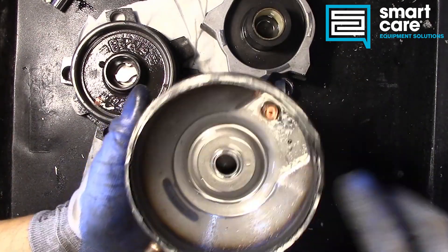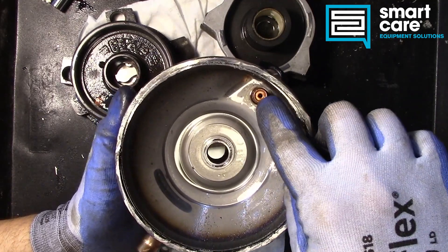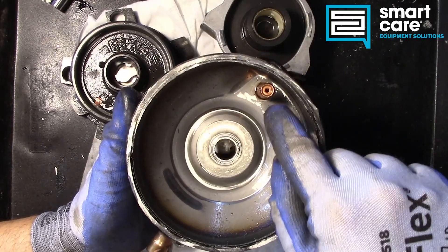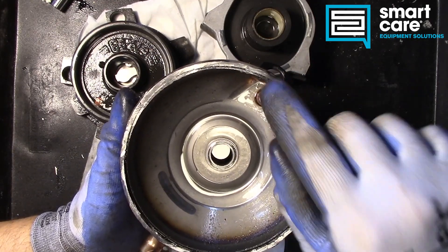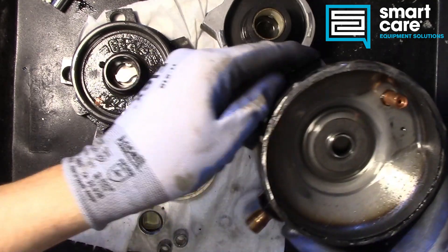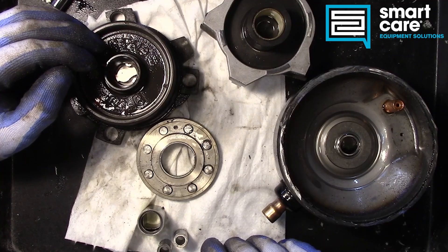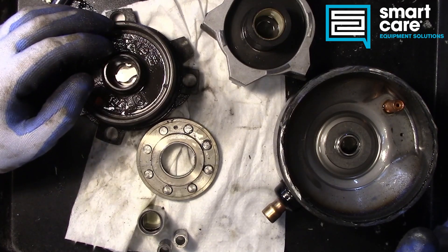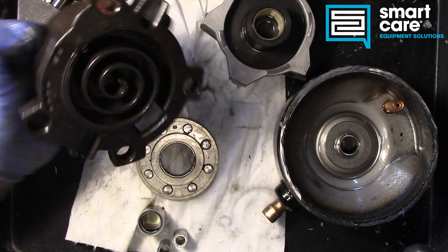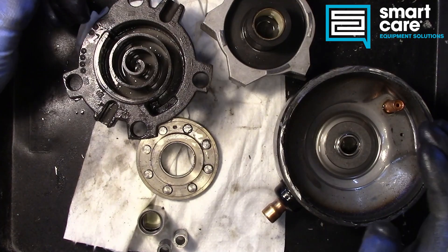Up in the top there's a relief valve — pressure over surface area acting on a plunger with a spring behind it. If the pressure in the top hat gets too high and overcomes the spring force, the plunger cycles open and dumps back. It's a strange shape and a strange assembly that doesn't really make sense until you can see how that spiral shape creates the squeeze.